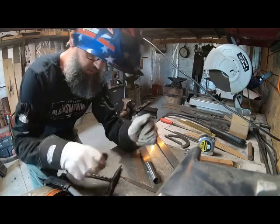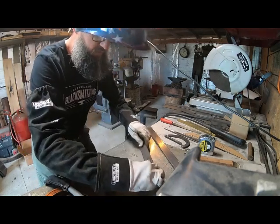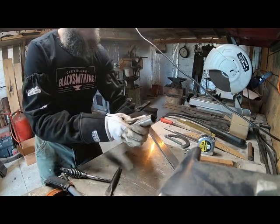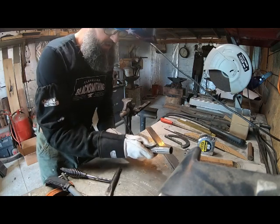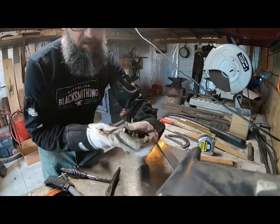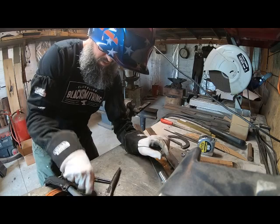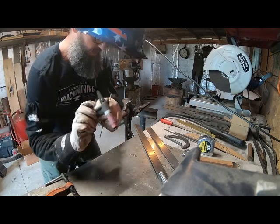So I'm starting off day two, putting in a little more work on the bow project. I got these pieces fit up pretty good. I'm going to tack weld this piece to this piece so that when I take it and put it in the forge and start forming that together, it doesn't move on me - I want it to be dead center in the middle of there. And then I'm also going to go ahead and weld my nuts inside that sleeve right there. And that'll all be copacetic, so when I go and start pounding on this thing when I get it hot, I don't deform it to the point that I won't be able to get that nut up inside there.